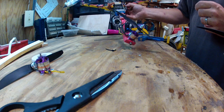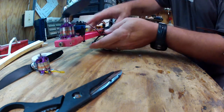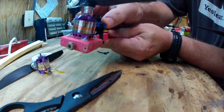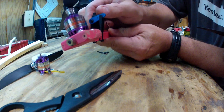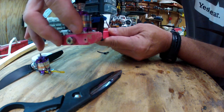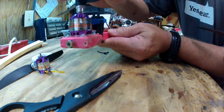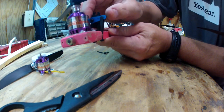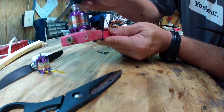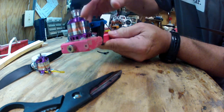Here's the setup on the back hinge — sorry about the broken prop, I let a friend fly this. This one's probably got about 20 hours on it so it's got a little bit of play, but that can be fixed by tightening things up in the back. Most of that play is actually in the servo — the servo's actually moving. It's not really play on the actual pivot point back here.